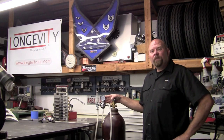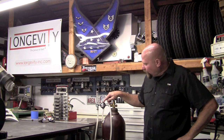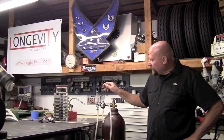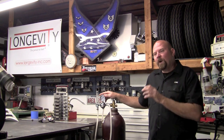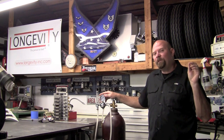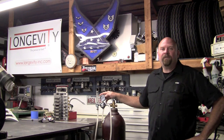For European type regulators that read in liters per minute — you can find that usually somewhere on the regulator itself — right here we'll have a flow meter. It's a simple conversion: liters per minute times 0.472. Basically, I just kind of use half the value.